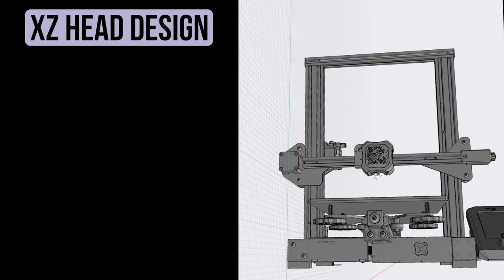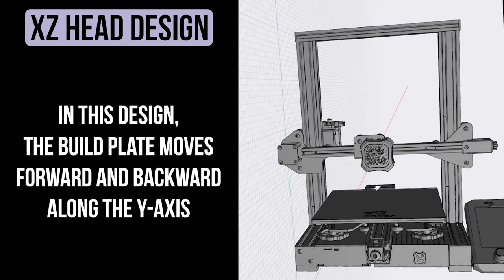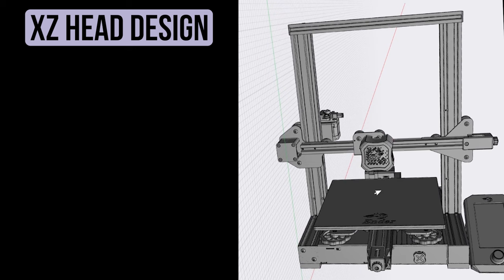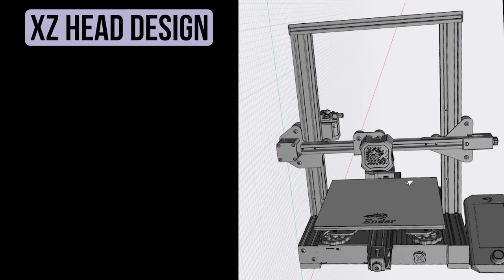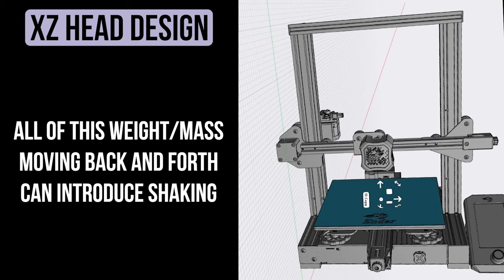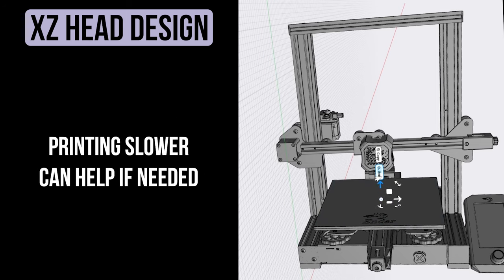So we have x and z covered — but what about movement along the y-axis? In the XZ head design, the build plate is responsible for moving forward and backward within the y-axis, by moving along the rail located beneath it. This coordination of printhead XZ movement and build plate Y movement allows us to print 3D objects within our entire three-dimensional build volume. This isn't my favorite design because it means having to move your print bed and printed object forward and backward quite a bit throughout the print job. All of this mass moving around can introduce print adhesion and quality issues, but there are lots of people who get great prints out of this type of system. You may have to print a little slower, but you may find that acceptable at a great price point.